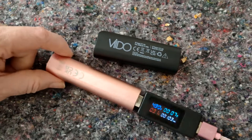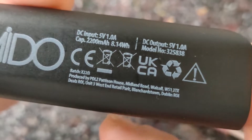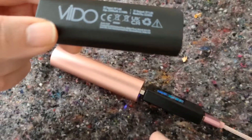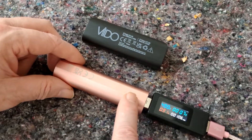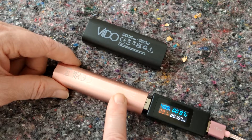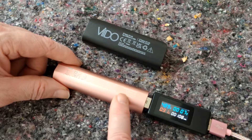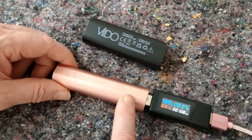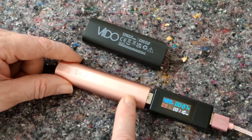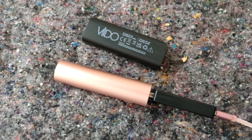I'm disappointed with this one because even though the Poundland one is only 2200mAh, I was getting about 55% out of it, so I'm probably getting about the same actual capacity. That was £3 from Poundland. This one says 2500mAh but so far I've been getting 1100mAh — that's about 40%. That's below par, and that's what I bought it for really. I'm sad now.